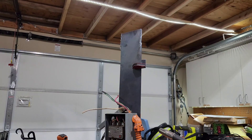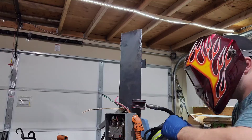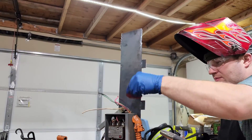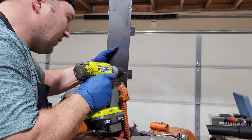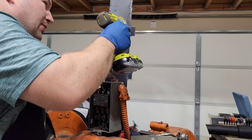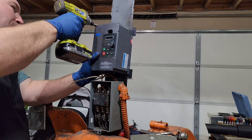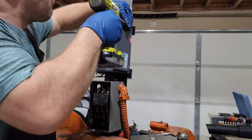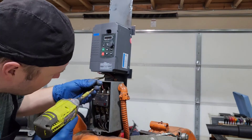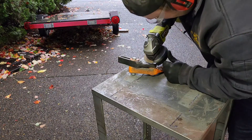They have been drilled out and now I am adding these tabs in here. I could have used a bigger piece of metal but I did not have one and did not want to go buy one, so just adding on some tabs seemed like it would do the trick. Does it look the best? No, but it is going to get the job done and provide a solid mount for this VFD. The VFD does not weigh a lot so you do not need a ton of structural rigidity there. I have pre-marked where the holes need to be and I am also putting in screw threads using my impact gun with a combination drill-screw attachment — a tap and drill bit integrated into one. You are running a risk using an impact gun to drive them in, but it works fine for thin sheet metal like this. Here I am just screwing in the VFD in the mount.